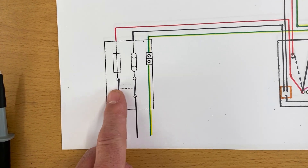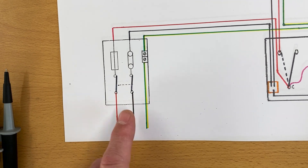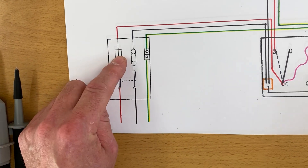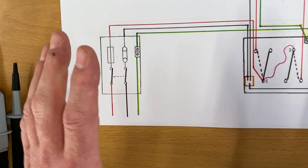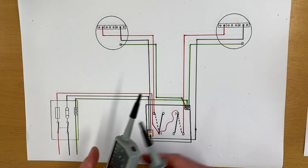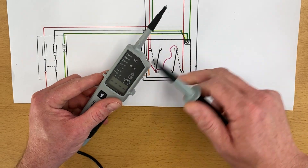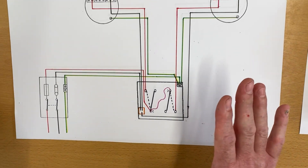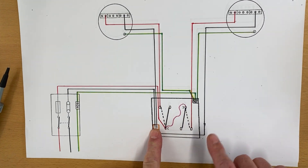On the drawing I've made the bottom section closed — on all my other wiring diagrams this is open — that's effectively showing the double-pole switch with our line and neutral tails closed. But the breaker was off, so it's single-pole and turned off. When we were doing our testing for voltage, we kept getting that continuity beep: whenever I touched between my neutral and protective conductor I got a beep — no voltage, but a continuity beep.